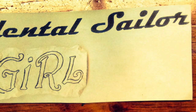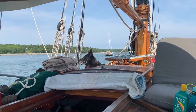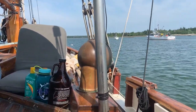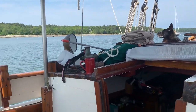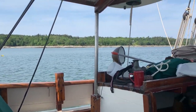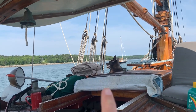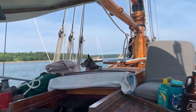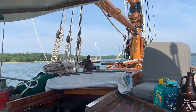We've got to take Miss Layla into shore. We are out of anchor and Norna is doing great — she's been swelling up nicely. The bilge pump hasn't even really been turning on, which is really awesome. Today we're going to do some rigging, tighten up all the deadeyes and the standing rigging, and bend on probably just the jib sails today because it's a little too windy for the mainsail.